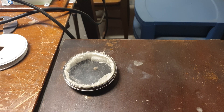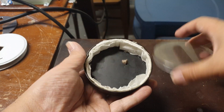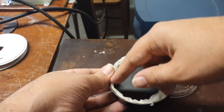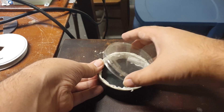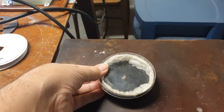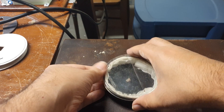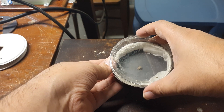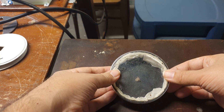Welcome back to Spark Starter channel. I want to give you an overview of my cloud chamber projects. This is the first cloud chamber I built — pretty simple. I had a petri dish, painted it with matte black paint, put some paper towels around the edge soaked with ethyl alcohol, and set it over a bed of dry ice. In a few minutes you'll start seeing traces of atoms shooting out of a radioactive sample — a little chunk of uranium rock.